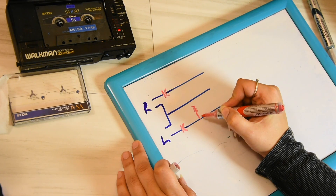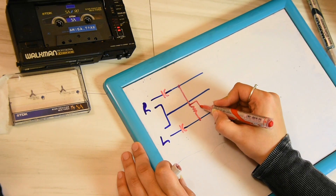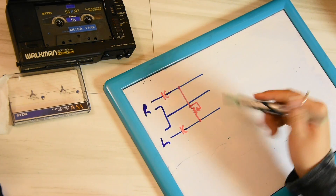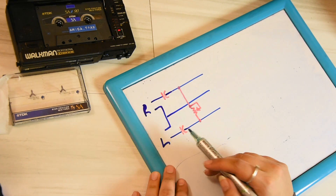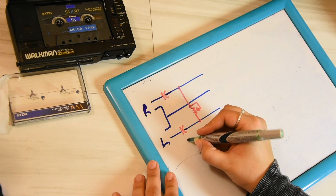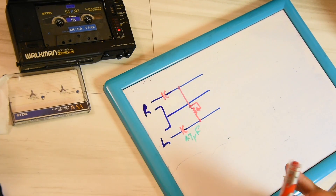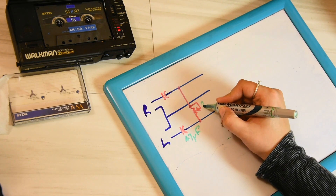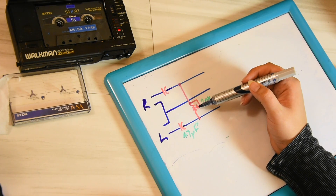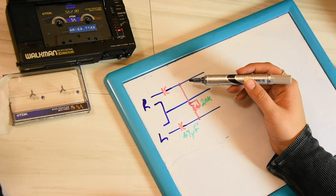The capacitor joins onto this, and this side joins onto that. The center is going to join onto one of the ends. The values — I'm basing them on what I've typically seen as DC blocking capacitors, which tends to be 47 microfarads. Let's do 20k for now for the variable resistor. When you put this all the way down, it's going to be shorted, so the right channel and the left channel are going to be shorted together, giving mono output.